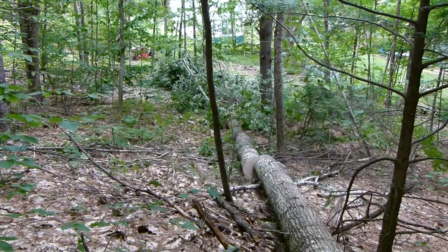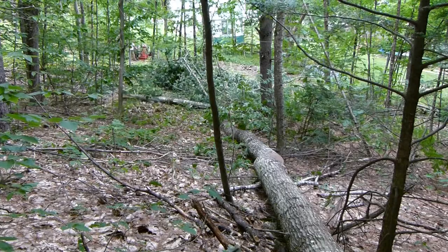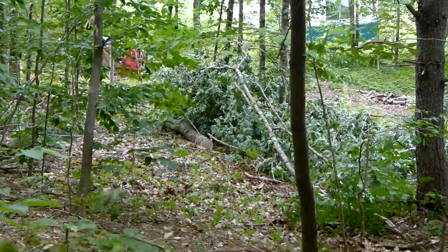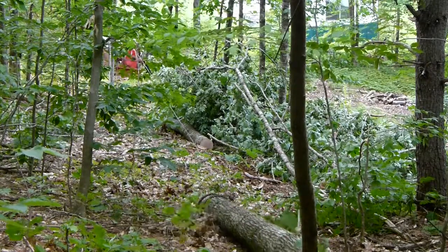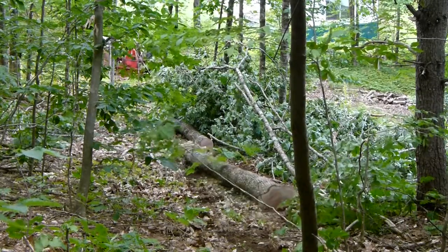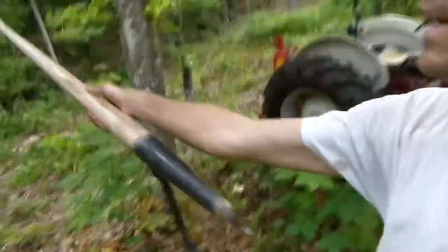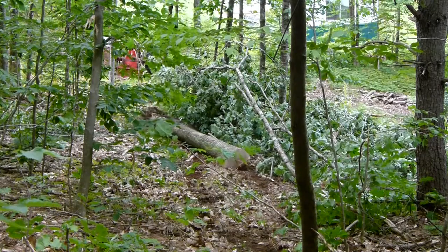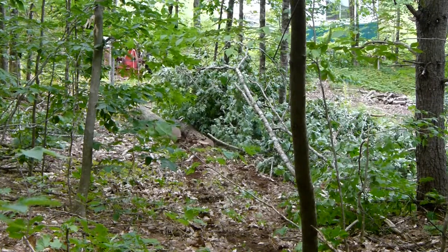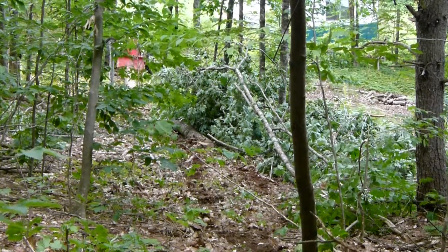I just felled the last girt — probably the last flat long piece of wood I'm going to need to mill. I got a couple more pieces to mill, but this is going to be a really big, really heavy — I think really beautiful — eight by twelve, sixteen-foot-long red oak. I notched it in this direction, connected the farm winch to it, and it came down perfectly without damaging really any of the other tops. I'm also going to get a bunch of splines out of this at six feet. Now I'm going to pull them out of the wood — this is the fun stuff.